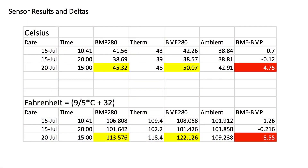Summarizing those three experiments, the greatest difference between both sensors when the sun is directly overhead approaches close to five degrees Celsius or eight and a half degrees Fahrenheit. This confirms the comments shared by many of you in my prior video that properly designed radiation shields should help mitigate bias in temperature readings due to heating of the housing transferring heat to the sensor. This is especially true when the sun is high on the horizon, but less important in the morning, late afternoons, or for sensors placed in the shade. This was an important step to take prior to formal data collection for future experiments.